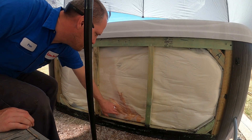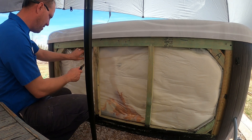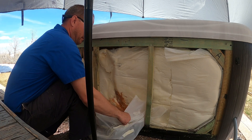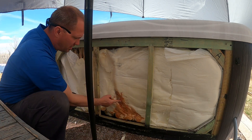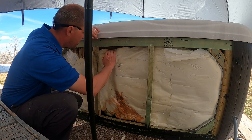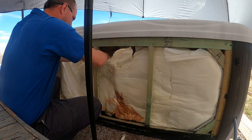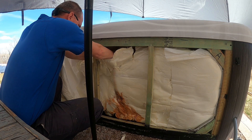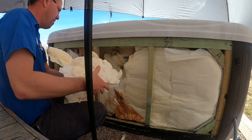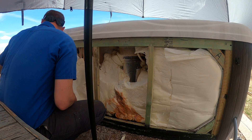You can see all this stuff right here — all the foam in there has been wet. I'm going to cut the plastic open here. You can see all that, just wet from leaking over the past few months. I like to try and remove this foam in as big of chunks as I can just to cut down on mess. Usually I just re-insulate it with fiberglass insulation, the batting foam.